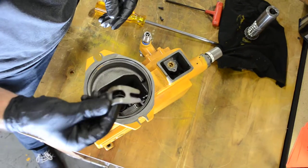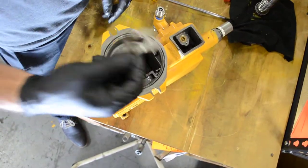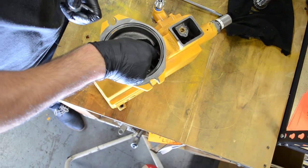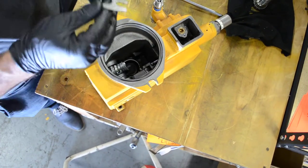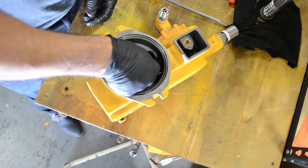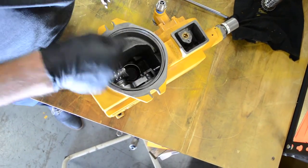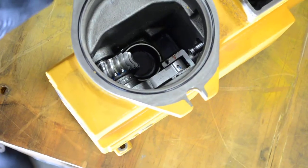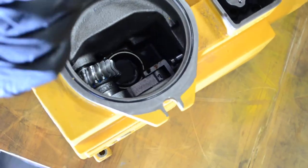If you want to put it back, same way — you're just going to put it in the opposite direction. There's a slot in the bypass actuator, the bypass tube, where this goes into the slot. That's how you take it off. I would leave the bypass rod in the control spool. So this is the first step.